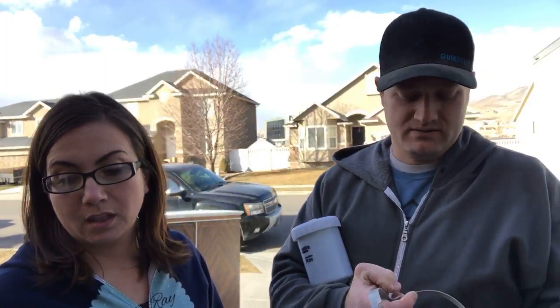One of the number one things we get asked questions on is spraying paint. We haven't done a ton of spraying recently because it's been cold, but it's about 45, 50, which is still a little cold, but warm enough that we can spray and it's not windy. Really, under 60, you run the risk of having runs and drips. It just takes a long time to dry, but it's not going to hurt this DIY clay-based paint or chalk paints. It's not going to really mess with them like it would an oil-based paint.